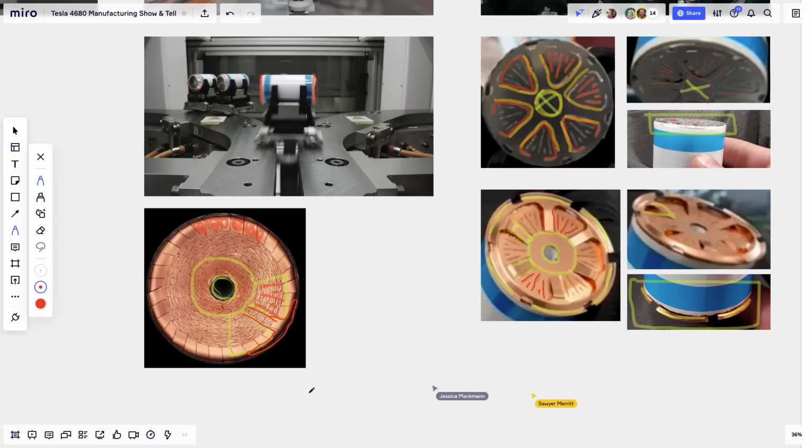So let's say you were to open the cell casing. Is this the top here with the laser welds? Is that the first thing you see? It's a good question, but you're going one step ahead. I don't want to confuse people, and I just wanted you to notice the hole here on the cathode side. There's no access to the hole anymore. There is a hole behind the anode, but behind the cathode current collector, it's only on the anode side that you still have a hole.